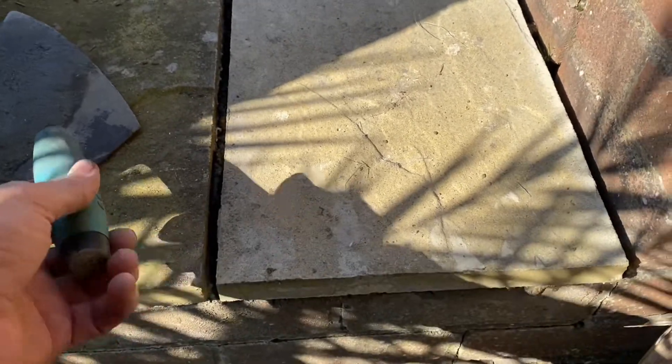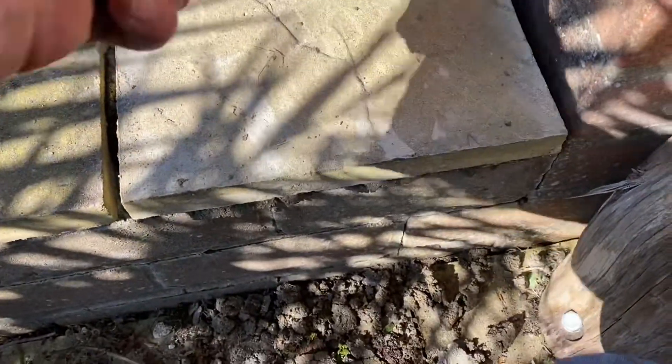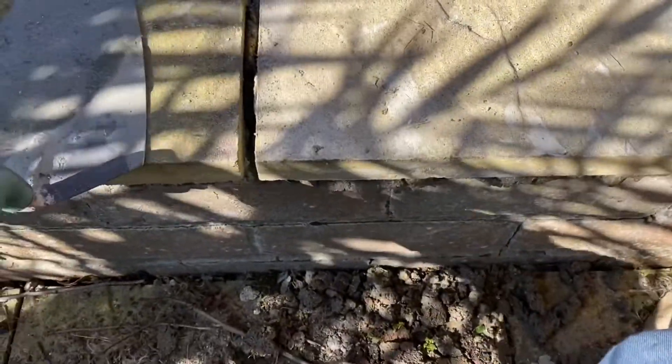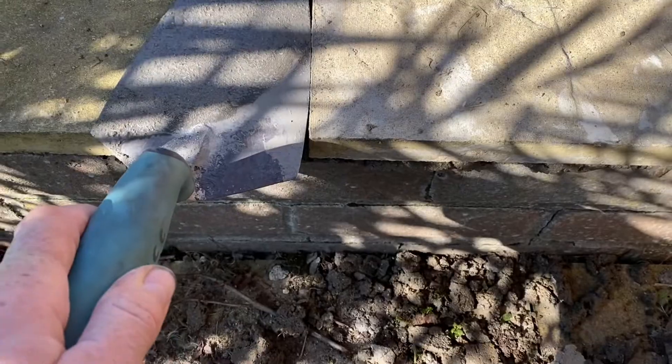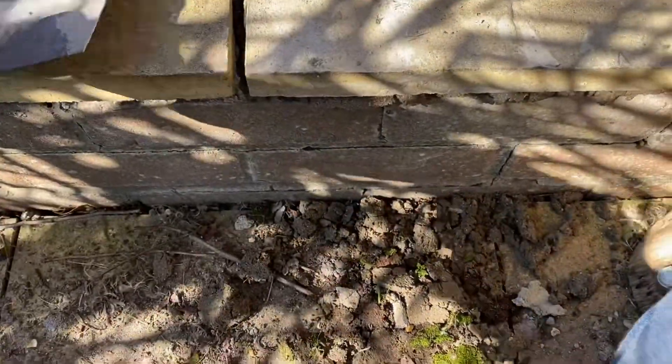So I've offered that up. I didn't bother using the level — I'll just come off two sides, lay my trowel up. It's pretty good to go, it's level there, so I just sighted that in by eye, and now we're going to point.